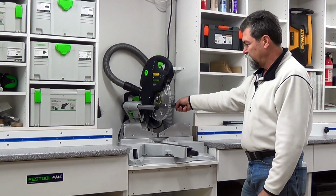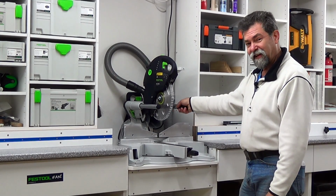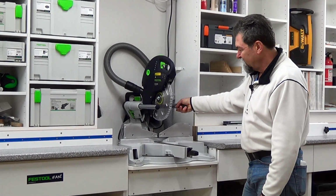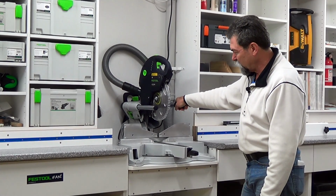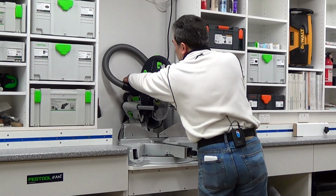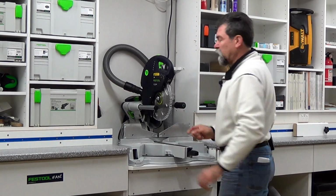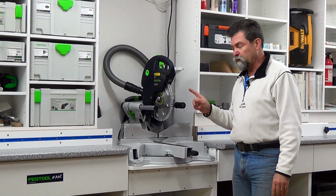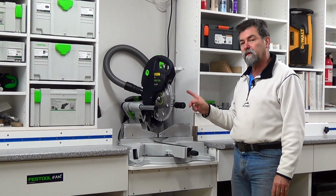Whilst we're talking about the protractors, this guy here is so good. Do you like that? I do. That's amazing. That lets me just set it to wherever I want, and I can hold on to the saw at that position, drop the clamp. Now I'm locked at whatever that is, 5 degrees. The 88 does not have that fine adjust on the angle for left and right.